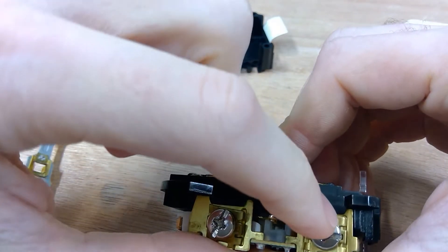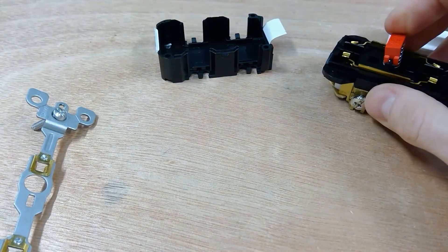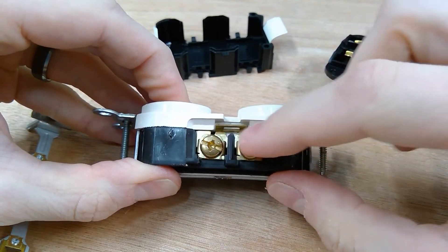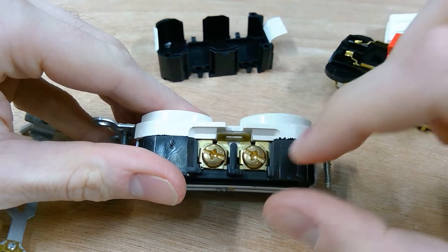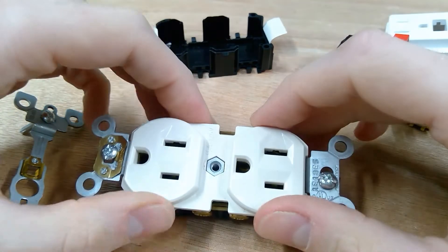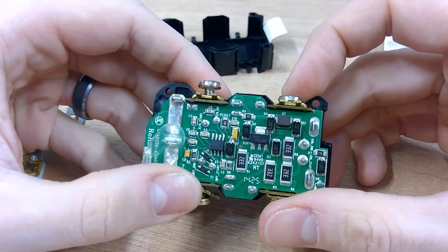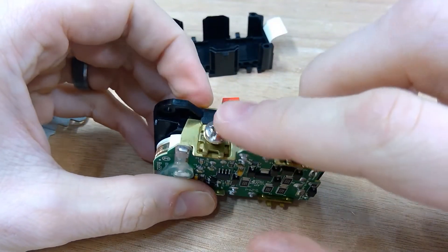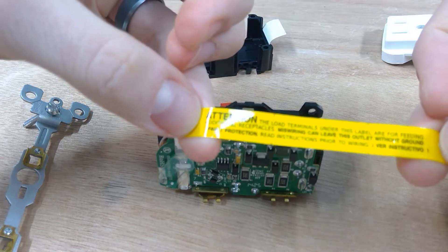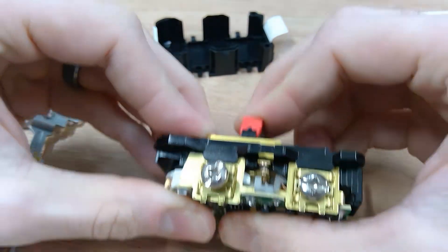Not only disconnected from this outlet, but also disconnected from the rest of the circuit — which again is why we need to make sure we install this thing properly. If we just look at a regular outlet, those two connectors are attached together with a giant jumper bar. We really can't get it wrong as long as we connect live and neutral to the correct sides. But with the GFCI, due to the fact that we need to be powering that circuit board underneath, we need to ensure it's connected properly — not just the right sides with the silver and brass screws, but also in the right direction, paying attention to the sticker that shows which ones are the load terminals for feeding additional receptacles, which are disconnected if that circuit trips.